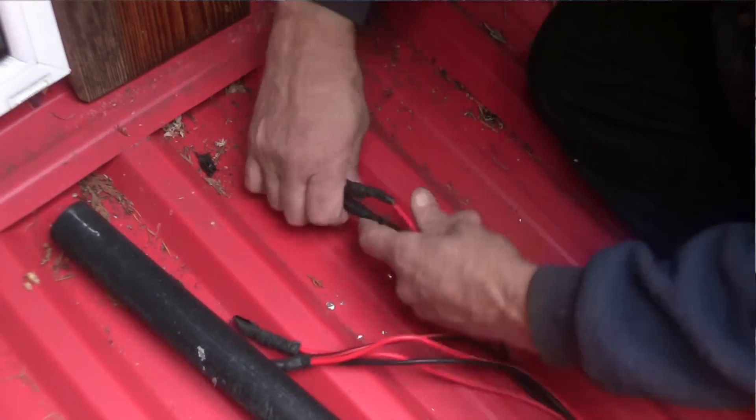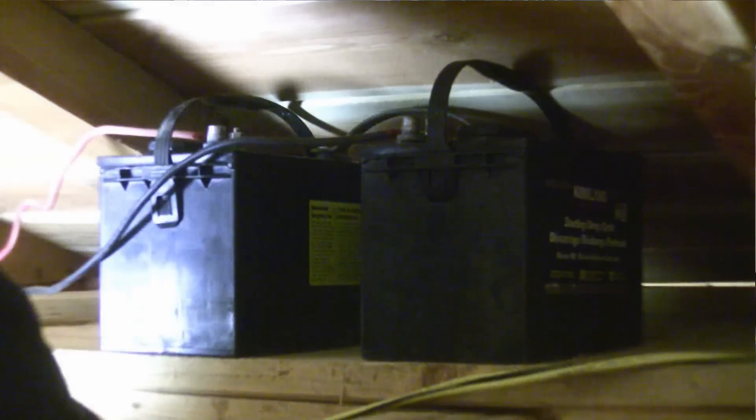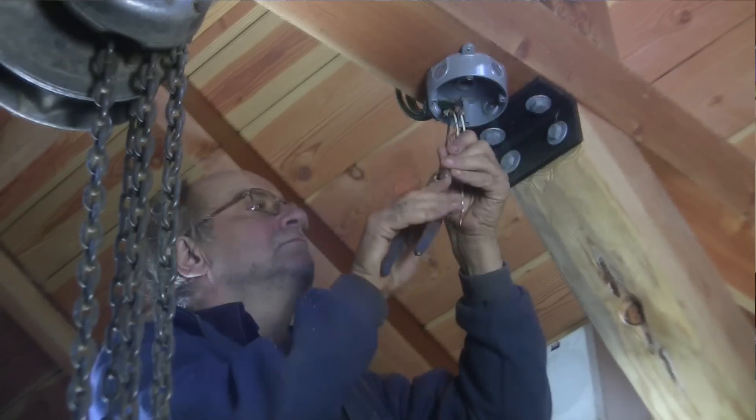Just a quick word about safety and fuses. I'm no electrical expert, but my understanding is that a good part of electrical safety is about protecting the wire. If wiring is undersized, things can heat up pretty quickly. So with that in mind, all my wiring between panels, controller, batteries and inverter is heavy six gauge — I bought it used for another good deal. The charge controller automatically disconnects if the power draw is too high. I plan on building in a fuse which can isolate the batteries, something I have to research a little more. Currently I run the power from the inverter via a fused power bar which protects the 110 wiring downstream. The downstream wiring is all conventional 14-2, nothing unusual about that.